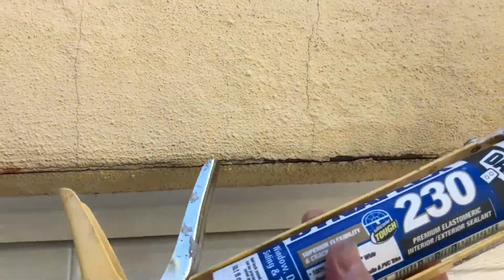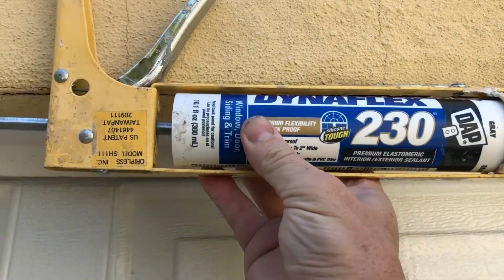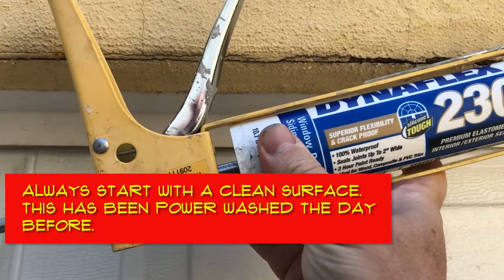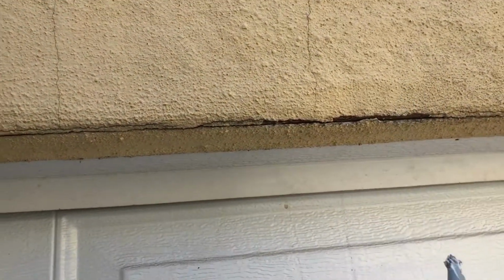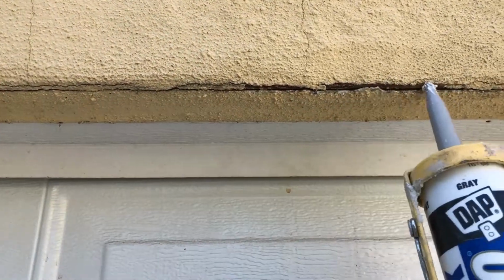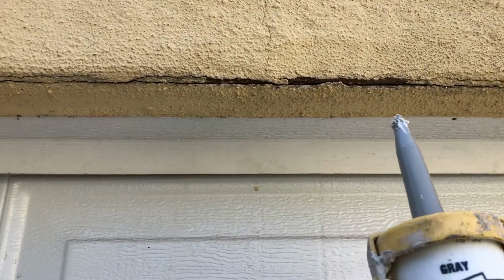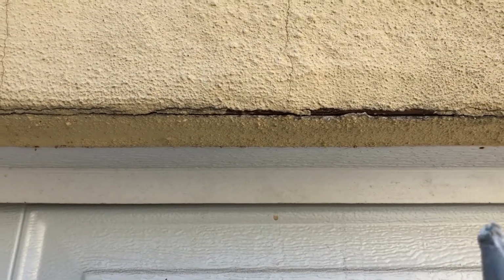Not silicone, because silicone you can't paint, but you take a silicone base, all right? And it doesn't really matter what you get as long as it's silicone based and it's water cleanup. The silicone base actually makes it more waterproof, and the fact that it's water cleanup means obviously it's easy to clean, and you can take a rag or whatever and clean your tools up.